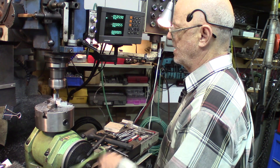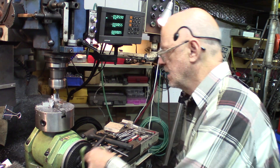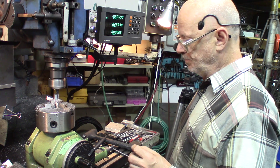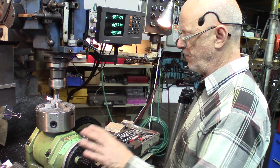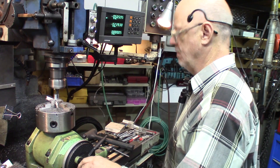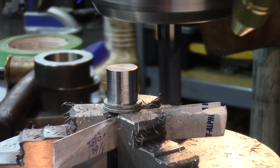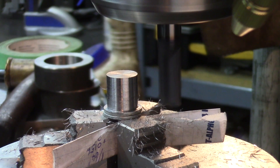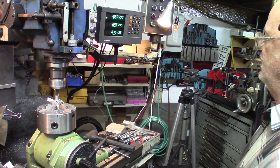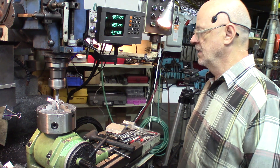We don't need too much of a spring pass. Let's get this out of there. Now we're ready for the six sides — let's move this out of the way a little bit and we've got to get the table down 150 thousandths. That'll be the shoulder. Going down 150 thousandths and coming back up to take up the slack.